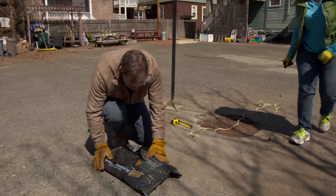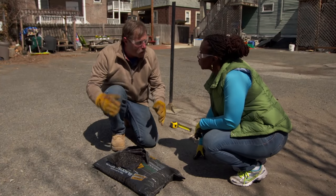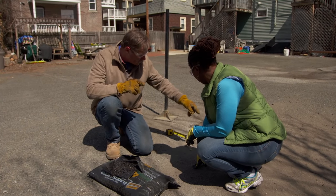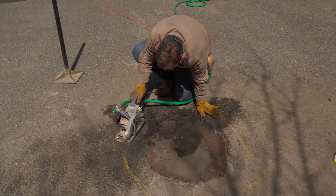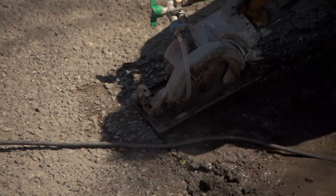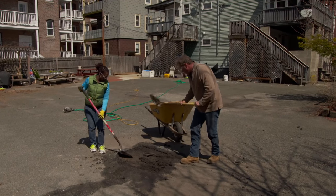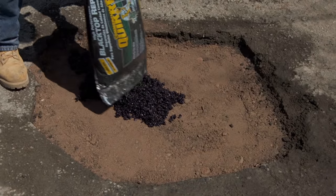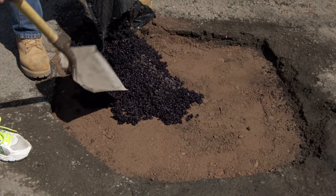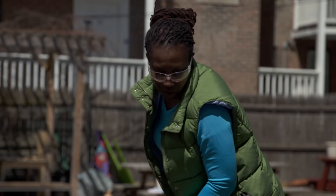Now what we're going to use for our top coat is this cold patch asphalt repair. It's stone mixed with asphalt binder. We just pour it in the hole an inch and a half thick, compact it down to one inch, and build up in layers. But before we do that, the manufacturer wants us to have a nice clean edge on the hole for this to marry up to, so we have to cut an edge. I'm using a wet saw with a diamond blade to make a clean cut. Now we're all ready — dump it in the middle and spread it right out, nice and even all the way through. We can't do anything until it's nice and flat.